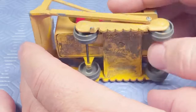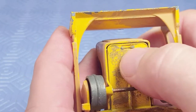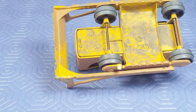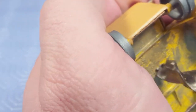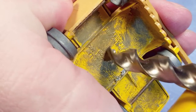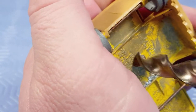This is a Matchbox King Size number three. It's got a rivet and then it's got this little spread post thing — I'm going to have to figure out how to take this base off. You can see the paint has been brushed on on the sides; it looks better on the bottom but looks really terrible on the sides. I'm using a three-eighths drill — it's a split point coated with titanium — and it cuts beautifully. I can do it very slowly until I've cut off enough of the rivet so that the base is going to come off.